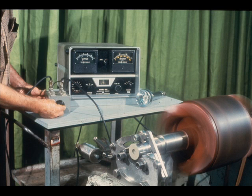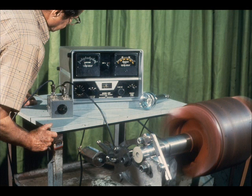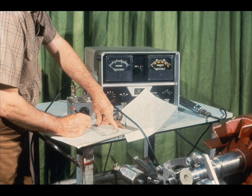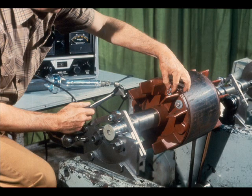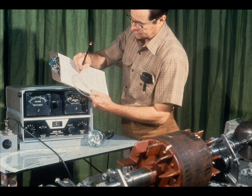The next step will be to switch back to the pickup at the first end of the rotor and check in again for any remaining unbalance. If the vibration that still remains is not within acceptable limits, it will be necessary to rebalance each end of the rotor until the required corrections are made. Here's a very important point to remember: approach the remaining unbalance on each end of the rotor as a completely new unbalance problem. Construct a completely new vector diagram for each end, disregarding the diagrams you used for the first phase of balancing. However, the balance weights installed during the first attempts should be left in place. Simply add the new weights where your calculations call for them. Continue the process until the balance in both planes of the rotor is within acceptable limits.